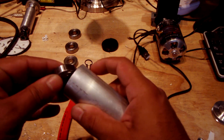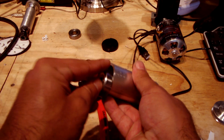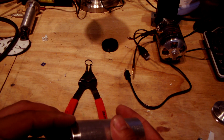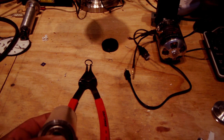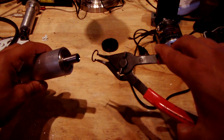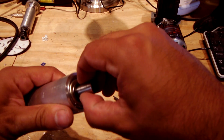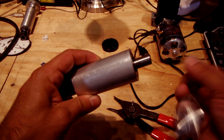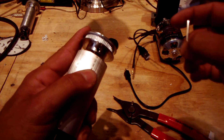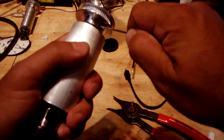Here's the final assembly for all of it. I'm going to put some bearings in there — third time now. They don't always go in when they're supposed to. I wouldn't say I machined it super tight, but it was tight enough that there's no space in between and no runout. But if it's even lightly canted it'll get jammed up in there. There's the old ring going on there. I machined a groove on that shank, and then you put the ring over the top of it — that holds it all in place. You've got to make sure that top fits on there. I'm going to tighten it up. It's more or less complete now.